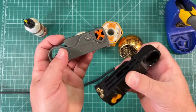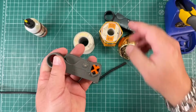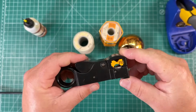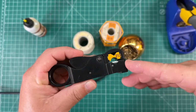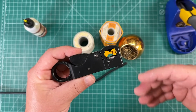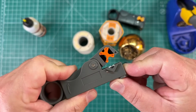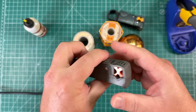You can get these things. These are coax strippers, essentially. This one right here, I got for about $2 at Harbor Freight. I honestly have no idea where I got this one, but this is for 213, RG213. You can also do LMR 400, Hyperflex 10, kind of any of the 10 millimeter or 400 size coaxial cables. And the way these work, these have razor blades in them. And they're just a spring-loaded contraption.